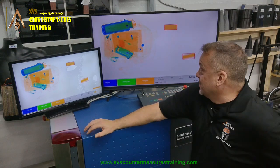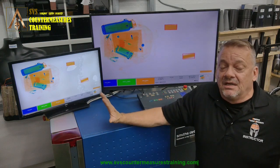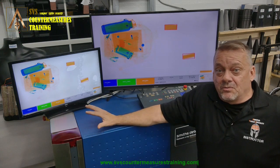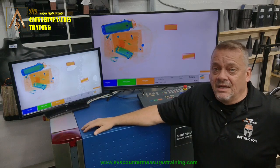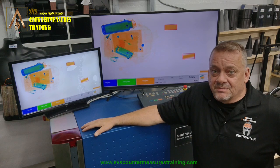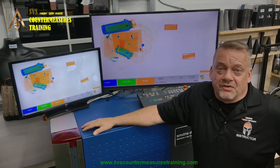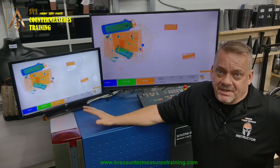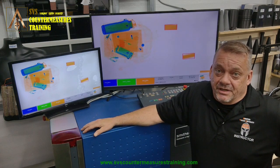This gives you a good idea on these systems. A lot of systems are moving the generator more toward the center to reduce this effect, which is a good thing. But most single generator x-ray systems — and even dual generator systems — are still going to have sweet spots that give you a better image based on belt placement. I hope this helped, and I hope you enjoyed the video.